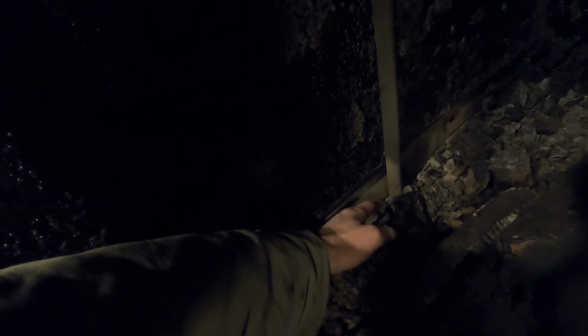These are just sheet metal that covers a channel, which is in the water box or in the water leg. And it makes a square air channel for the primary air to run on the left side and the right side. So I took that off. There's just two bolts. It comes off pretty easily, two nuts actually, acorn nuts. And I cleaned out the creosote. So I do that annually now during the summer before I start up for the fall.